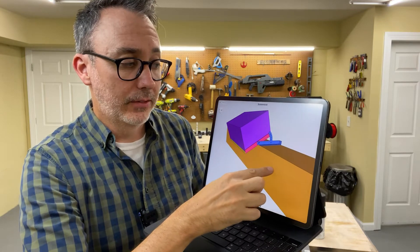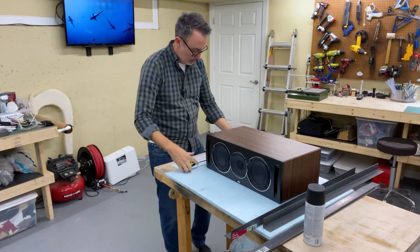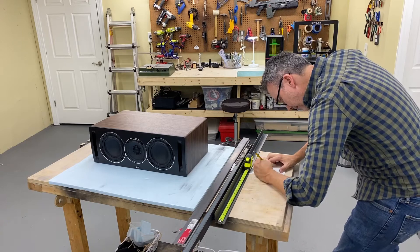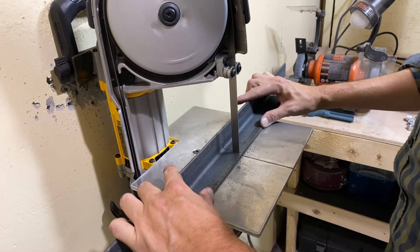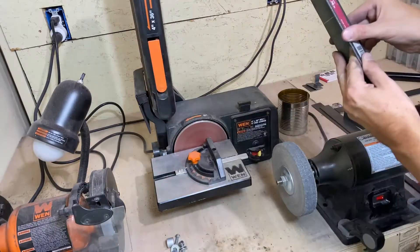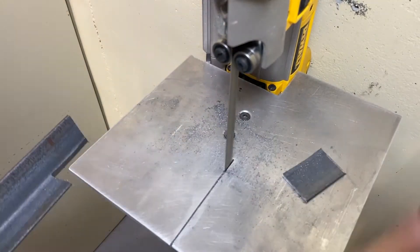This box here is the screen that he's suspended from the ceiling, and then he wants to mount the speaker to the top and be able to pivot it down to dial in the correct angle. The first step is to measure and figure out the correct dimensions. Then I mark my cuts on the stock and cut the pieces to length on my wall-mounted portable bandsaw. I used my disk sander to square up the edges.